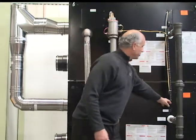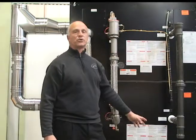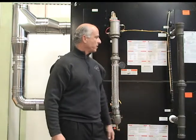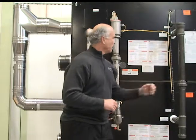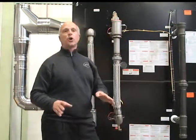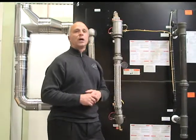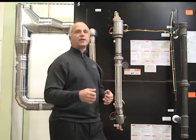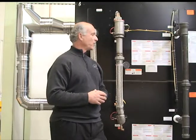You can see this black conduit here — we actually tie in the electrical too, so you only have to bring line voltage into one boiler, which would be the bottom boiler, the master, and that will power up the follower. We even wire up the communication cable for you, so this is all pre-programmed — the cascading is all set between the two boilers.